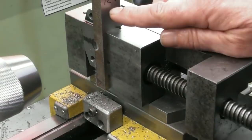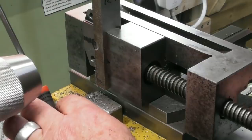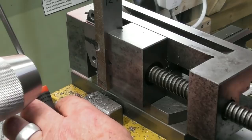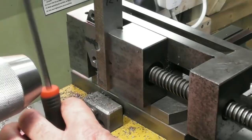Don't want to go making a silly mistake now. Dialling in to 13.95 on the DRO. That's it — 13.95. So I'll just do up my cross-slide lock, don't want things jumping around. Now, in much the same procedure as you've seen me do before, I'm going to drill an 11mm hole through and then whack a 12mm milling cutter right through.